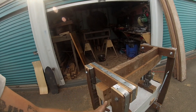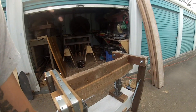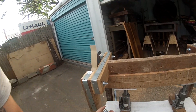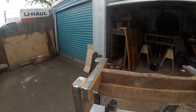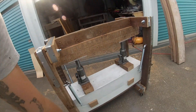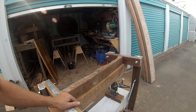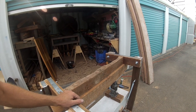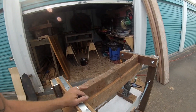I wanted to show you some upgrades I made to the skateboard press. I put some strapping over all the timber because basically when you put pressure on the pistons it wants to split. I ran the bolts through there and up through there, so I strapped all of them top and bottom. Then I put this extra ridge in because it was flexing a bit - they should have been turned the other way but I got lazy.